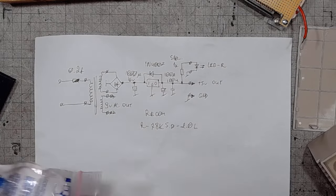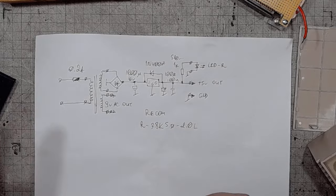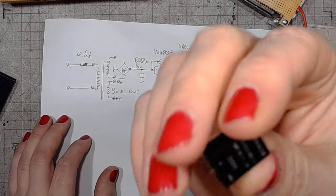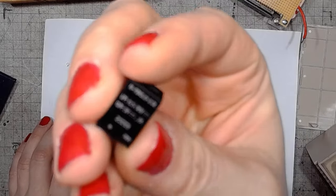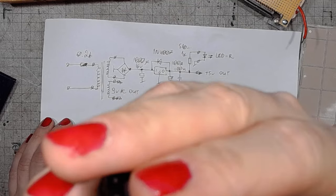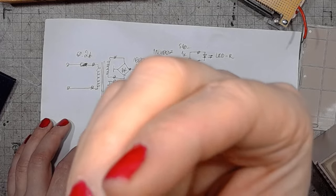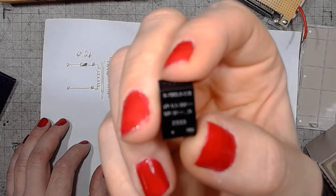The voltage regulator was made by Recom, a company that I know from the time when I worked for Enelion. This is this pesky little bugger. It can regulate up to 2 amps on 5 volts. Isn't it impressive? Just a teeny tiny bit bigger than the 7805 or LM317. Look at that! Beautiful!